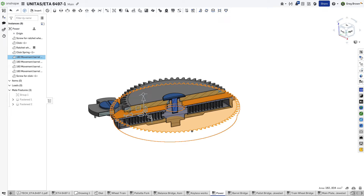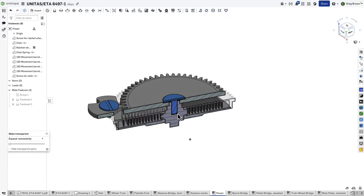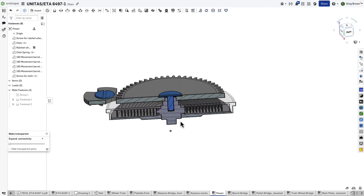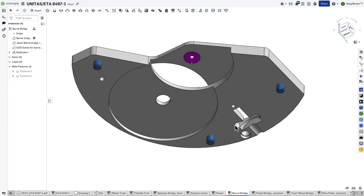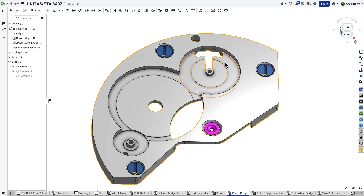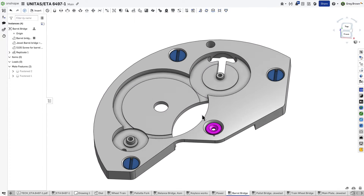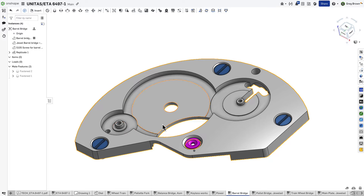Another sub-assembly worth looking at here — this is where the mainspring sits, which holds all the energy and releases it. This is a clicker, like a ratchet mechanism, to make sure that when you wind it up it doesn't unwind itself spontaneously. There's also this plate, which has a lot of aesthetic design to it but is very functional — it houses and locates the bearings very accurately for the power train. The spring sits under here and the clicker stops it from unwinding.